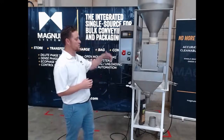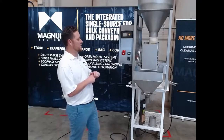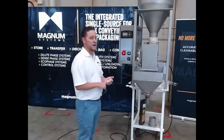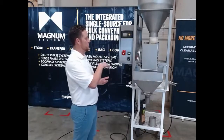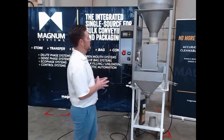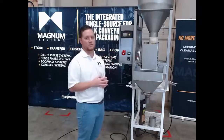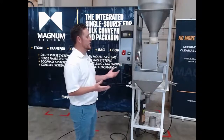What I'd like to do now is walk through the features of the TE10C design — how easy it is to clean as well as disassemble without the use of any tools. The hopper is simple in shape, which helps promote product flow, reduces any bridging or rat-holing issues. There are no internal welds or crevices that would allow for product buildup. It's also not bolted down — it rests on top of the frame, so you can take it right out once empty, wipe it down and clean it, put it back in. No tools, and it takes a matter of minutes.